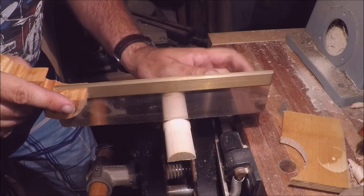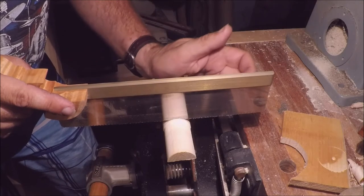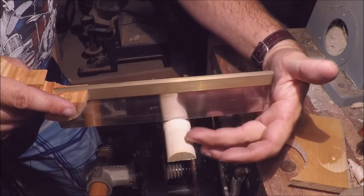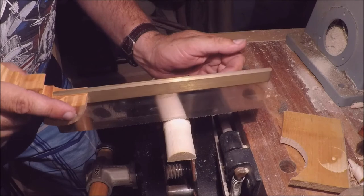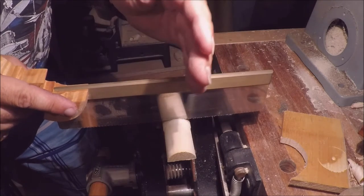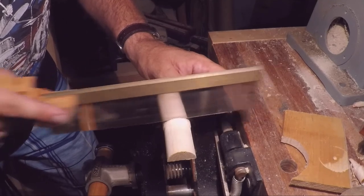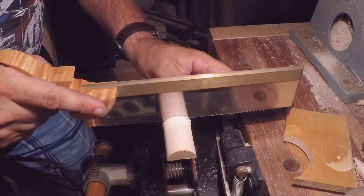One of my best tricks for cutting stuff square: I didn't put any line on this and you really don't need to. Notice this saw is really shiny - look at the reflection of this dowel in the side of the blade. As I cut, I'm looking at that, and if I tip it I can see it change. I'm trying to make it look like that dowel just passes right through like it's going through a piece of glass. If you can do that really well, then you should be cutting square.